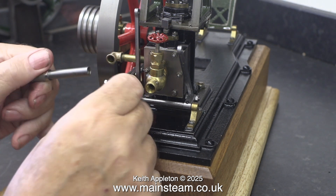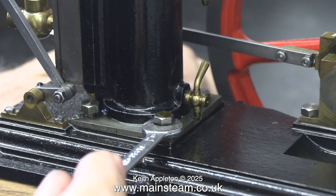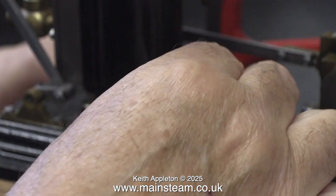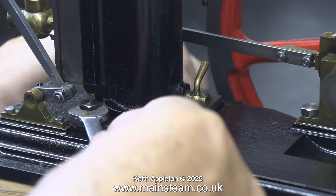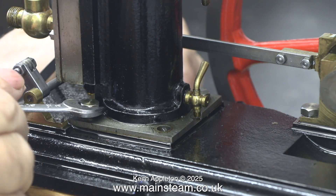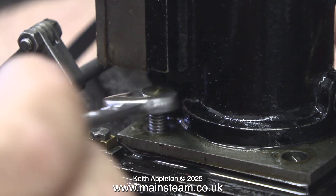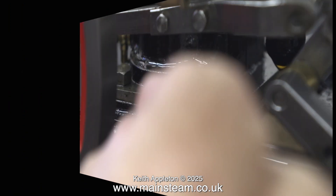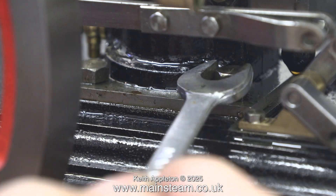Here I'm removing the pin which holds the eccentric rod to the upright rocker arm. This was a horrible job — incredibly tedious and very slow. I had to keep rotating the spanner and couldn't even use my fingers because the thread on the bolt was a very tight fit in the hole in the casting. Just so viewers don't slip into a coma, I'm running this at a higher speed. I nearly slipped into a coma several times actually doing the job. After a while, I removed the first two bolts, turned the engine round, and did exactly the same on the other side.